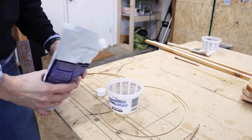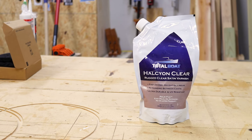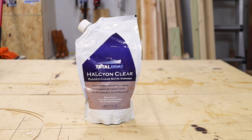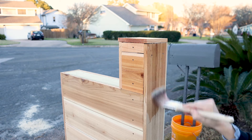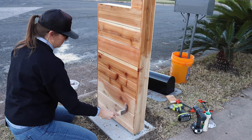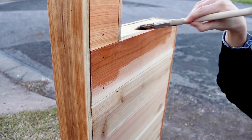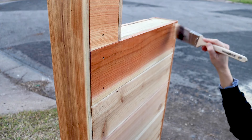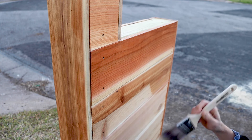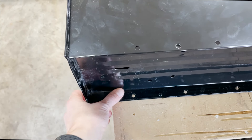The last thing to do before adding the mailbox was to add some finish. I love the way cedar looks, and I wanted a finish that would preserve the natural cedar color and prevent it from turning gray over time. I'm using Total Boat's Halcyon Clear Varnish, which is an excellent choice for exterior projects. It's super easy to apply via roller, brush, or even spraying. It provides excellent UV protection from the sun, dries fast so you can apply another coat within an hour, and dries to a clear satin finish that accentuates the wood grain and improves clarity.